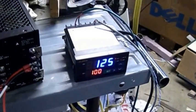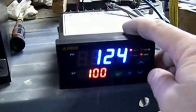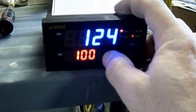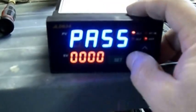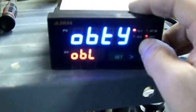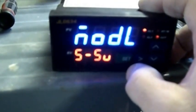This is the JLD 634 temperature controller. Right now it is manually controlling the set point. What we're going to do is switch over to step-by-step mode, which I've already got a bisque cycle programmed into. We'll put in the password - 89 - and switch to the mode. There we go, stepwise set point.